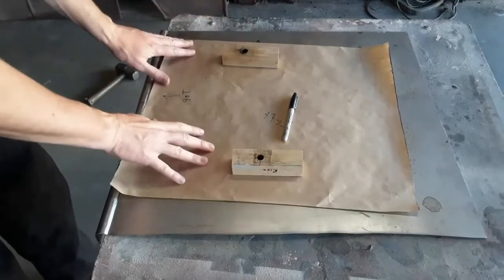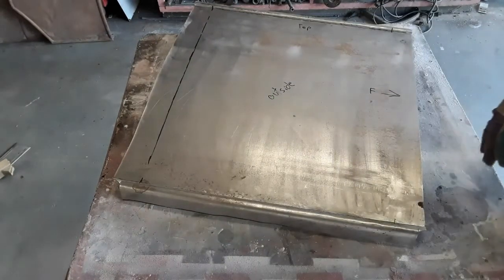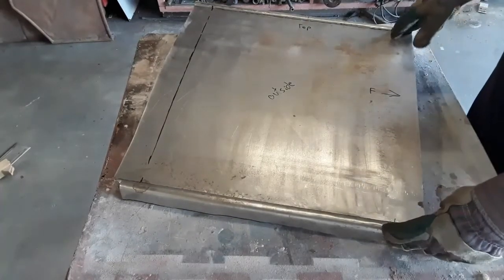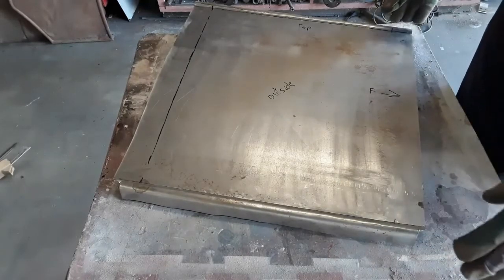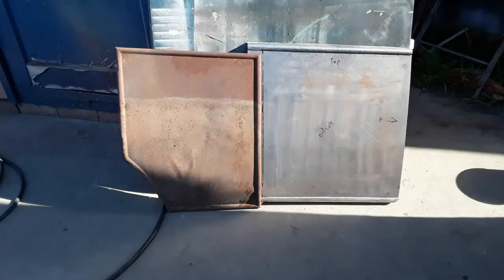And the lower bead is done. I'd like to point out that the upper bead - the edge is bent over 90 degrees on the top. The lower one is not quite that, because the panel curves in as it goes down. The next part we're forming is the door jamb against the rear door. I marked it on the side panel according to the pattern, and right now I'm standing the door up against it with the door lines parallel to see if the beads on the top line up - they should be parallel with each other. The upper beads look to be parallel with each other, or close enough, so that's a good line for the door jamb.